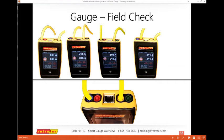If you're close, but not at the 1%, not the end of the world. It also confirms that you're checking your tubing. So you do want to check your whole tubing section, whether it's the blue or the green or the red or any other tubing you're using, but your numbers may be slightly different. The longer the tube, the smaller the pressure, the smaller the number. If you're just going to use a little short piece of tubing, you could end up with numbers that are 700, 800, 900 Pascal, but our goal was to find something that would be a good standard.